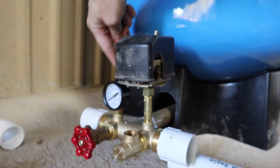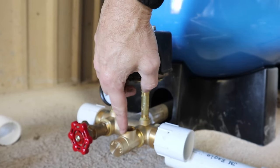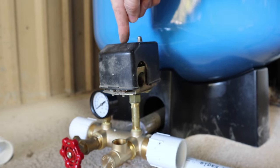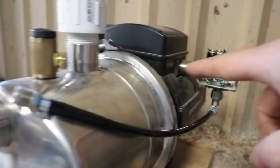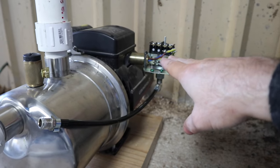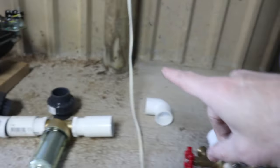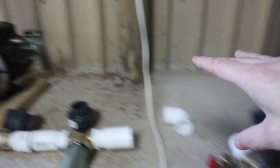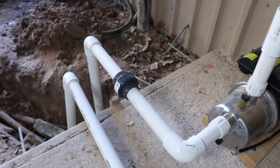From that point we come into our pressure tank. We've got our pressure gauge, our drain valve, our relief valve, and our pressure switch. This switch will be wired for pressure. The switch over on the jet pump — I've taken off the pressure line, so it will be wired the exact same as normal. As long as I keep that line disconnected, it will get power from this one over here. This one acts as the pressure switch and the other just acts in powering the pump itself. And here's our dry fit: union there, supply in, discharge out, check valve, spin-down, and unions in both places to remove those parts if needed.